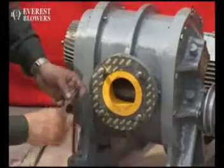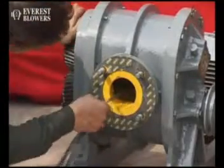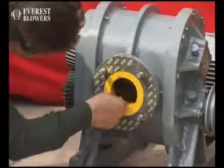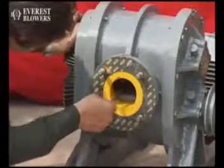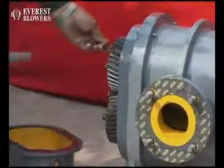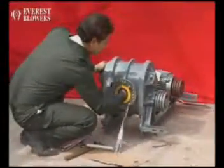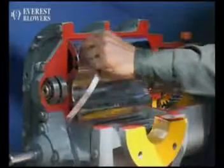Repeat the whole process with a higher gauge. Preferably take a step of 0.002 inch gauge until uniform clearance is set all over. Tighten the gear bolts and now check for the side clearances. Follow the same process to set the side clearance right.